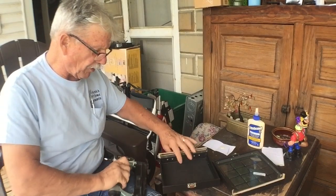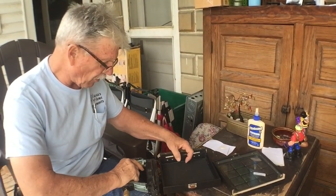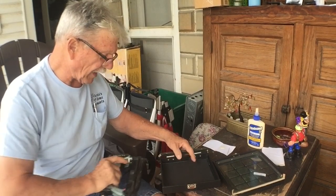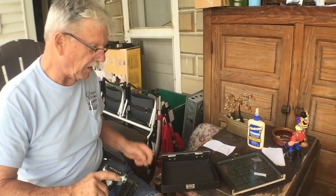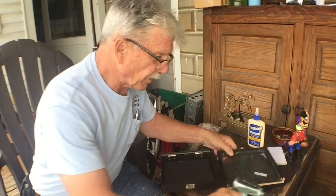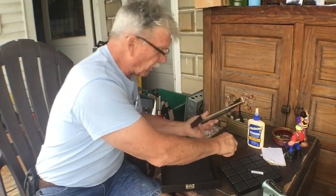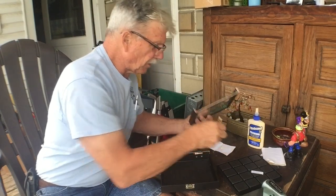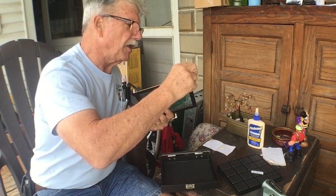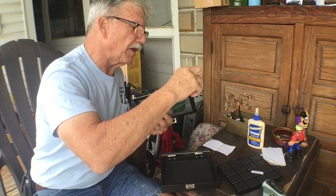And the pin nailer is the only real way to put this together because it's such a small, intricate nail. If I try to use a trim nailer, like a brad nail or something like that, it would be just too much and blow the actual little particle board apart. So we're going to continue and then put this together. What I'll do is probably just do these corners up like this and put the glue on these, put it together on the other thing, and close the box up before I actually shoot it together.